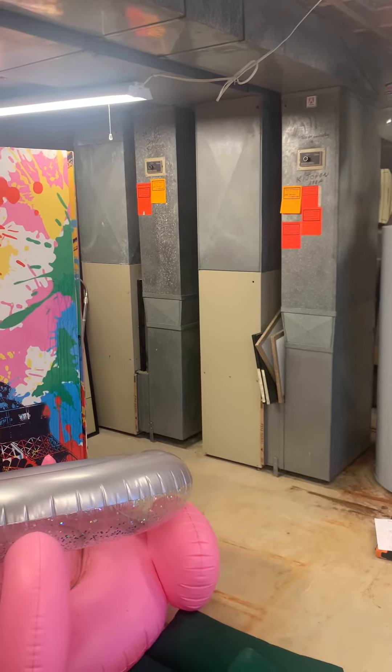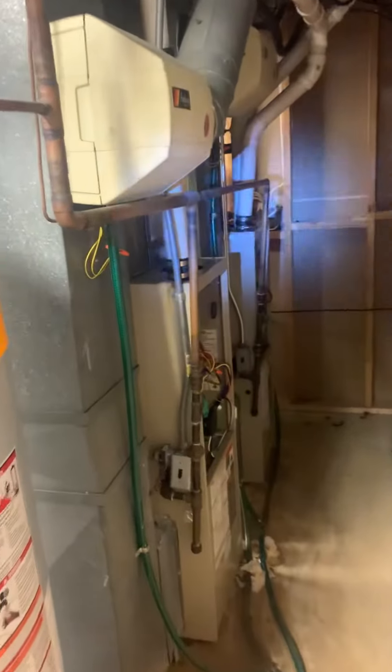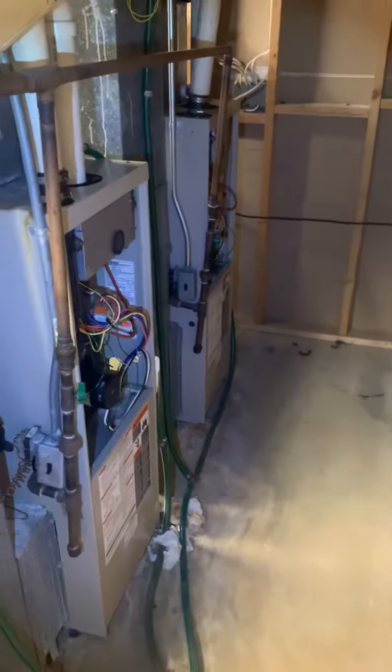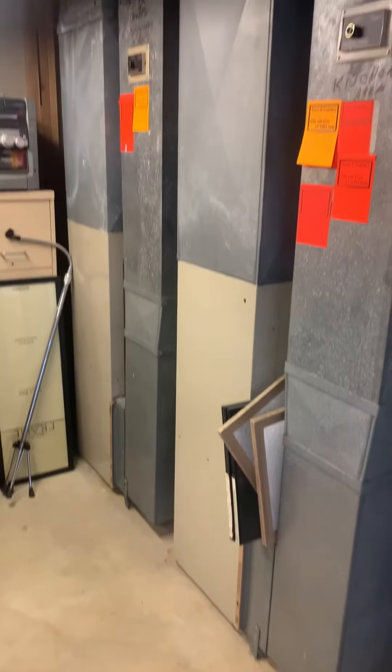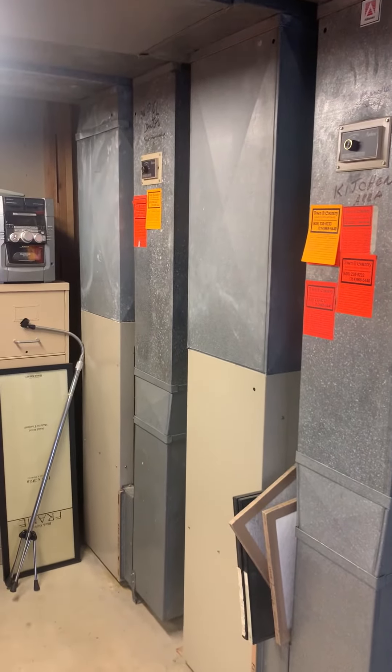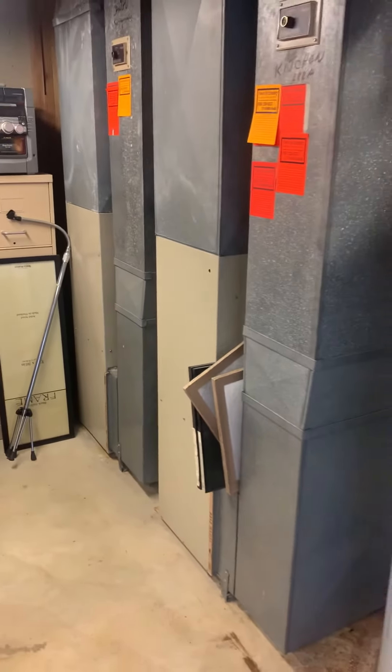There's not a lot of room to be able to service these. The refrigerant lines we're going to have to flush, because those are actually running all the way to the end here, up and through the finished part of the basement for a good probably 30 to 40 feet. So what I'd like to do is actually turn these furnaces so the front of them are possibly over here, which I'll discuss further with the install group. But basically keep the refrigerant lines on the other side, keep the A-coils facing that way, but then have the furnaces turning on this side over here.